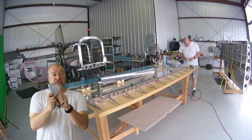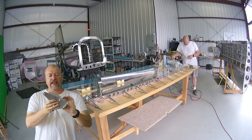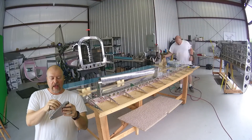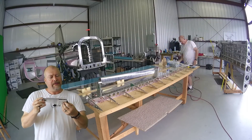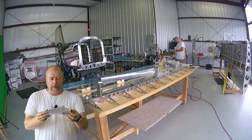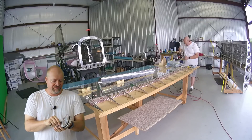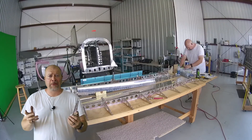This is the center one — it's got this middle layer here that's all riveted together, so this was going to be stiff as heck anyway. But the ones on either side don't have that; the only thing holding those two pieces together are those four rivets. So that makes me think that moving from the 3-3-5 up to a 4-4 was probably a good idea because this is pretty stout. I can go ahead and recommend doing that unless someone has a reason why not to.